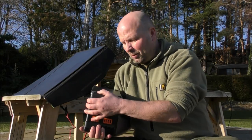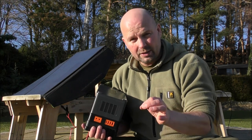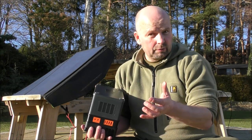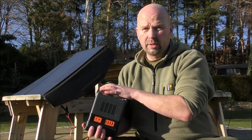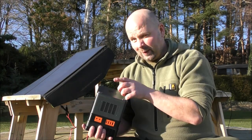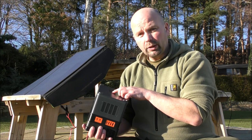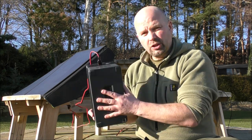Now here's where this gets confusing. This is called the 500 — I've seen some videos where folks say the actual capacity is 666 watt hours, but other videos and information say it's 606. On here it says continuous output 500 watts, which is why it's named the 500. Surge: 1,000 watts — so if you plug something in that draws too much power, it will supply it for a short time but then cut out to protect itself. And then it says capacity: 164,000 milliamp hours, brackets 606 watt hours. So yes, 606.